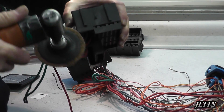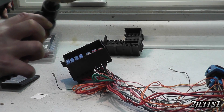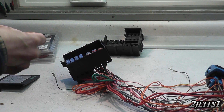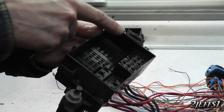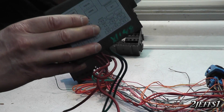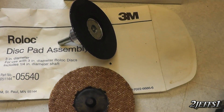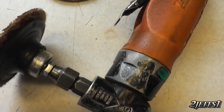If you want a cover on your fuse box, you can just take that little nibble off there. I use these Roloc wheels from 3M — the gold ones. They don't really grind so much but they dress stuff down real nice. Take a piece of plastic or aluminum, use your two-sided tape, stick it to that, cut a slot in it, and you can take the cover, put it in that slot, and lock it on. These are nice little wheels — you can polish metal with them and they work good for grinding on plastic. They're a quick-lock device; that's your arbor drive for your die grinder.